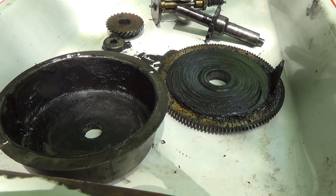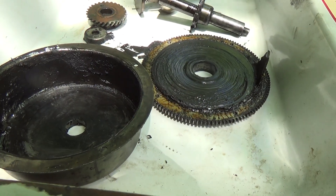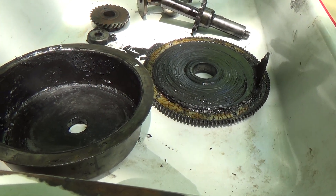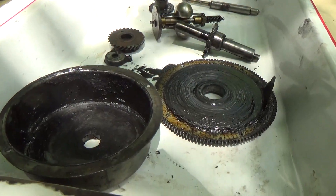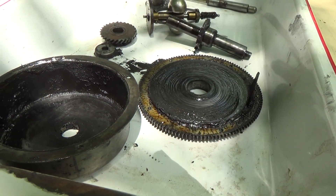Sometimes things like black graphite powder can be a little hard to get, though you can still get graphite grease — high-pressure graphite lube is still around. I just hate putting black grease on anything because then it looks dirty and it gets everywhere. It's extremely dirty grease — it does work very well, but extremely dirty. For something like this motor, it's going to get a white grease with the lube, because even though that spring looks pretty good, I know it's going to be minimum 50 to 60 years old and may be a little weak. So I'm going to err on the side of caution and go with the lighter grease.